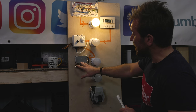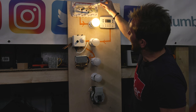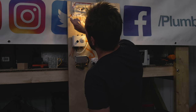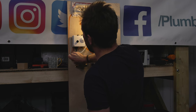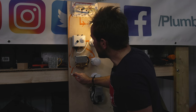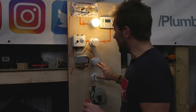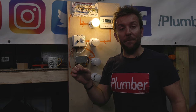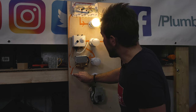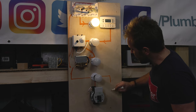Right then, guys, so we know that we've got an orange wire, a permanent live orange wire that comes from there and goes all the way. Let's just draw it down here. An orange wire that goes all the way down here and then gets switched inside our valve. And when does it switch the valve? We know when, because that little arm, when we saw it, opens up and pushes on that switch, and that's when the valve is open. Then it can send a live supply into our pump and also to our boiler.